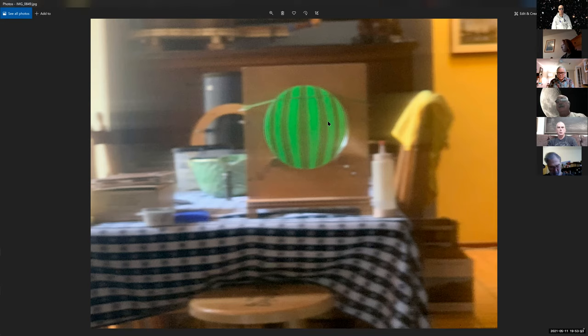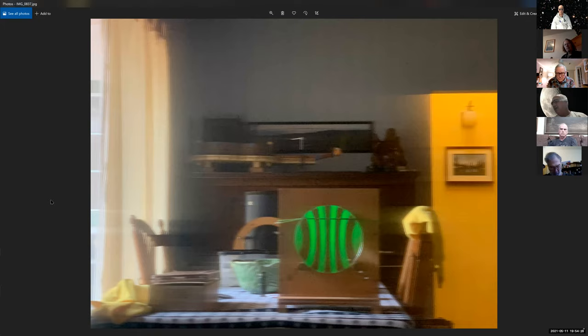And basically what Tom, when I sent them to him, I said I would really much appreciate you taking a look at these. I had what I thought was a turned edge. When you use a knife edge, when you throw the LED beam down and bring it back, and you're right at R, at twice the focal length, it's going to show you something like that. It's going to show you an image where you can really see clearly the highs and the lows. If you had a pin stick on this, that little shadow where the donut is going around is probably near the 70 zone. And there in the 70 zone, you get a lot of detail.